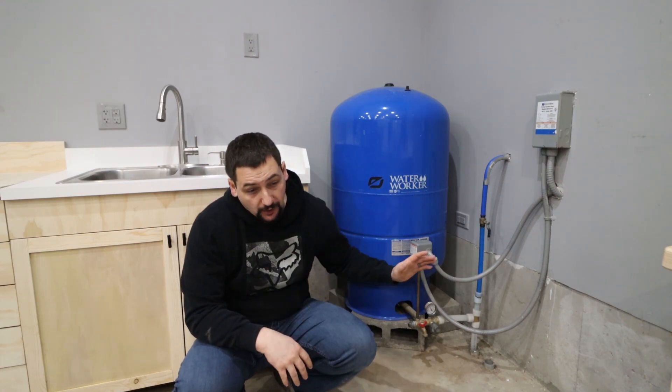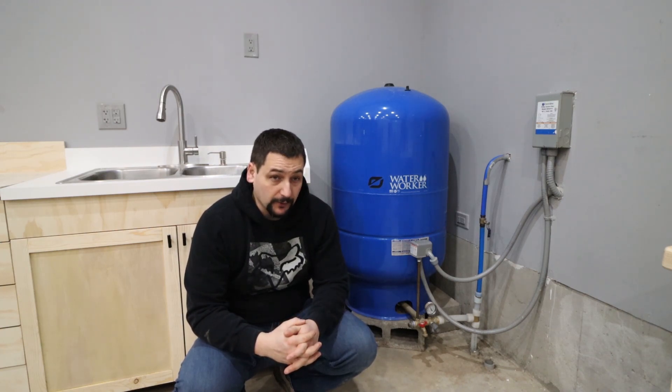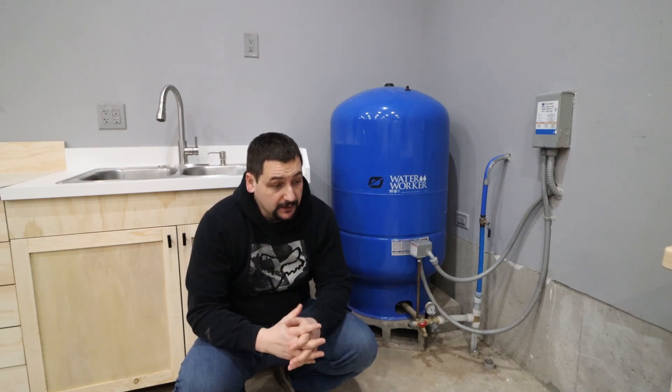By removing all those fittings — the 90s, the T's, relocating check valves, reducing all that restriction, and putting in tubing with minimal flow restriction — the gains were negligible. I was hoping for a significant gain but didn't have a good way to test without just doing it. I'm glad I did it — I upgraded the underground piping from white PVC to PEX-A tubing, which is a much better product, and it's a much cleaner install in the shop. I'm most pleased about the space I gained. I may be investigating a booster pump down the road. I realized I don't actually have flow problems in the house, but I want to put in a sprinkler system and hoped to up the flow rates to supply more than one sprinkler head at a time. Hope you enjoyed, and until next time, thanks for watching.